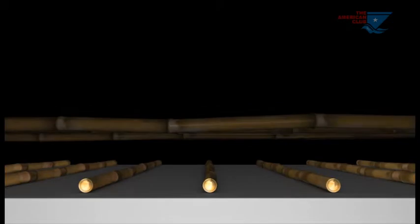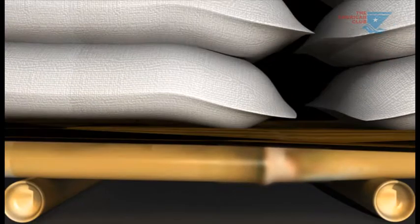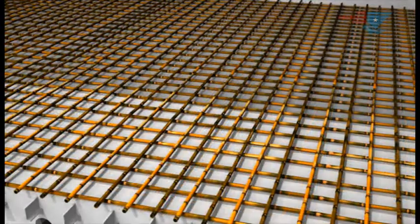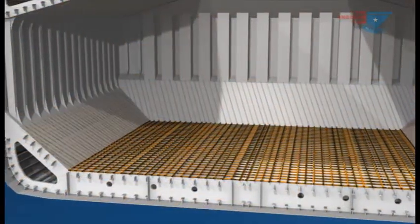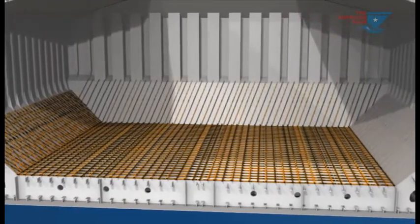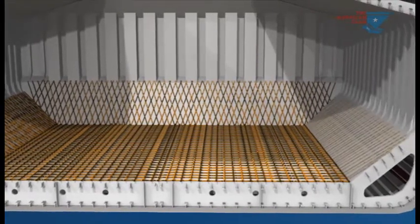This size is designed to prevent bags from sinking due to pressure of cargo on top and touching the tank top. Smaller squares are created for longer voyages and larger for shorter voyages. A similar pattern is created on the lower side shell plating and fore and aft bulkheads.